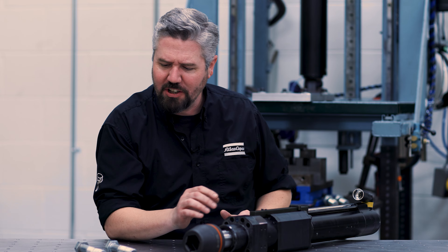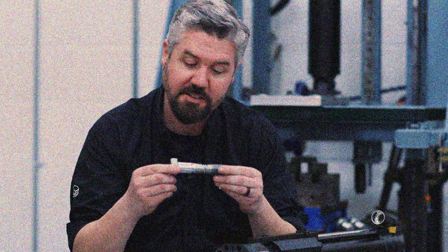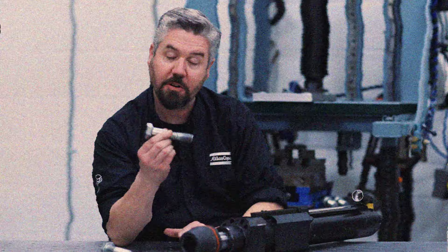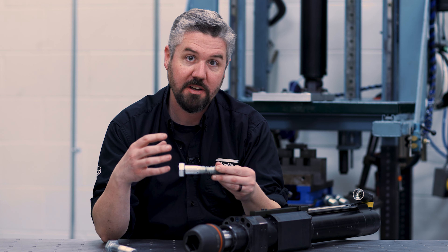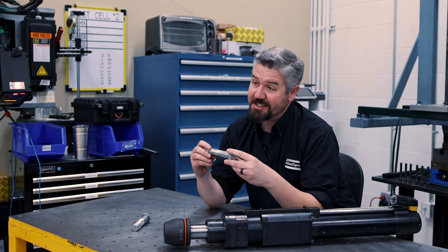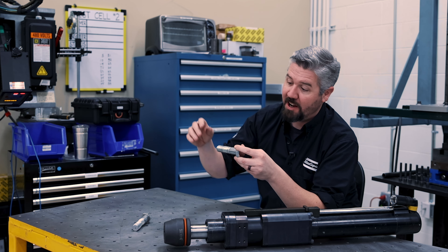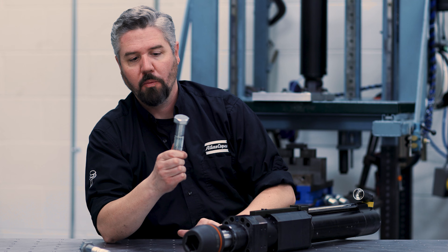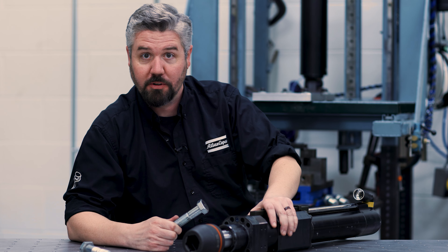Hey, I'm Jason and welcome back to In The Lab for Season 2. We had so much fun breaking stuff and doing some really wild experiments in the last season. We went back to the very beginning and took a look at the first video we shot, the M24 failure test. We set up our 1750 Newton meter fixture power tool and broke this bolt at 100% speed. Looking back at it, I realized there's even more information we can look at from the high speed film of this bolt breaking. So we're going to break down the different stages of tightening up until the target torque and beyond until we break this thing again, and really look in detail at the different stages of that assembly. Let's get to work.